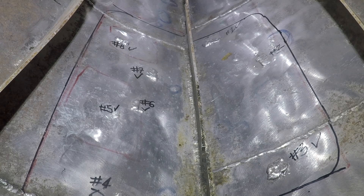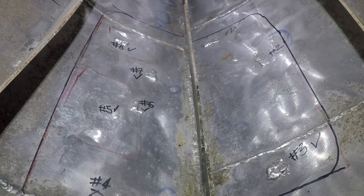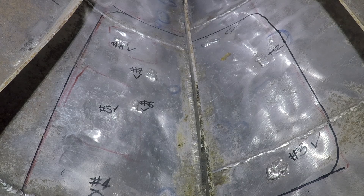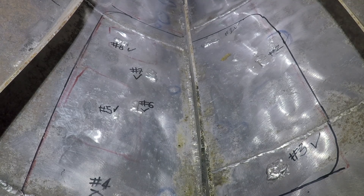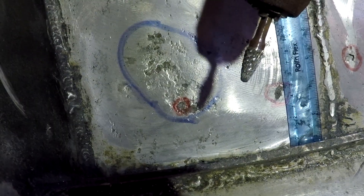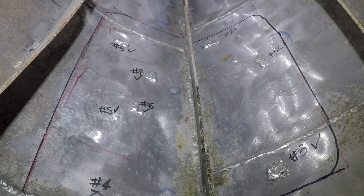This section here should really be replated. I am lucky I can haul out for free whenever I want, so down the track I'll replate these little sections. But I just wanted to get back in the water, so what I did is I drilled out the really bad pits — only two or three of them — and the others I just ground out with the die grinder and burr, then pad welded on the inside. The ones I drilled out I put a little extra weld on the outside and ground it smooth. It'll work and it'll probably be fine, but it's not best practice. I'll cut this out eventually, but for now I have every confidence it will hold.